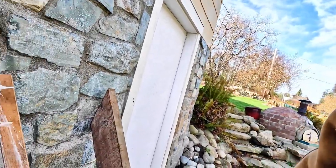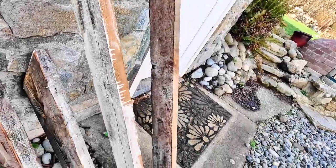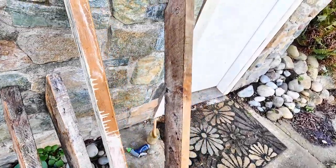And then I put this perfectly crystal clear urethane coating on it inside my basement where it was warm, because I ran into trouble with one of my oak beams that turned white when I did it outside. And then look what happened. It is a disaster. These boards all turned white.